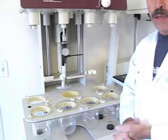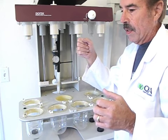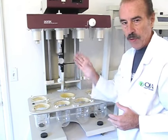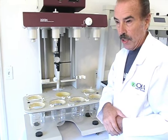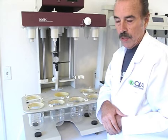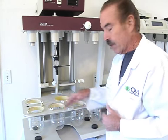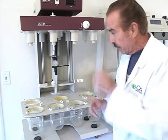The next thing you do is take that number and divide by two. That's because of how USP defines centering — the axis of the spindle being coincident with the axis of the vessel within a certain amount. So you take the total indicated runout, which in this case was 1.7 millimeters, divide it by two, giving approximately 0.85 millimeters. We're well within the USP requirement of two millimeters, and actually within the ASTM requirement of one millimeter, so this meets both.